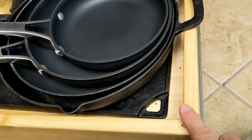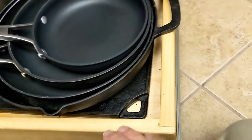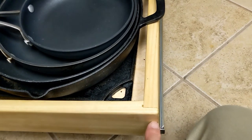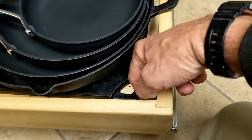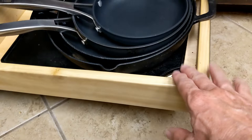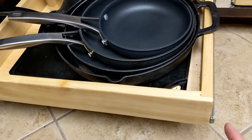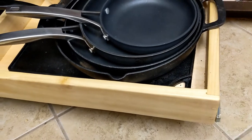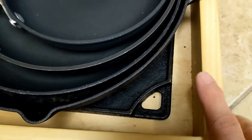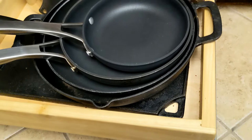This is built with 1-inch poplar by 3-inch in height, and I have rabbeted the edges, but you can just as easily do a straight frame here with a screw going in, and then you would just recess them and fill them, and that would look fine too. You can also use your Kreg tool and make screws that come in from the inside. I do like the recessed plywood that I chose to use, which was half-inch. So this isn't some cheap pressboard bottom — it's half-inch plywood. I actually use Mediterranean plywood, which is very expensive, like 60 bucks for a 4x4 piece, but it has a lot of plies and it's got a shiny surface on one side, and it looks almost identical to what the poplar looks like with the Danish Watco oil natural finish, so it's a very good blend for the inside. And it's a little more slippery, so that'll make cleaning a lot easier.